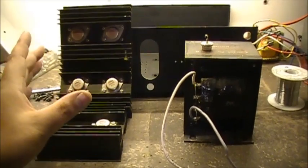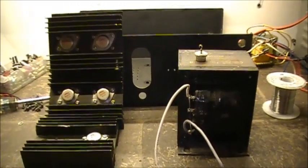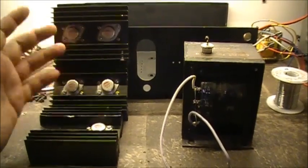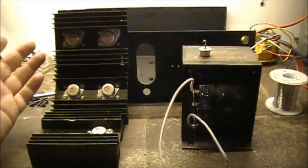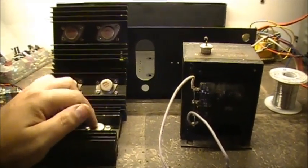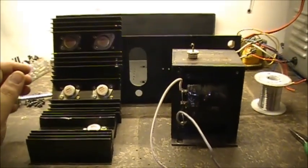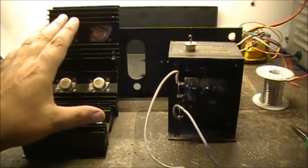But it's a circuit that I found years ago, that basically for every 2N3055 you add to the circuit, you can gain approximately 5 amps. So you use one 3055 as your driver, and then the other 4 as outputs. So technically you should get 5, 10, 15, 20. Should get 20 amps with a driver. According to the schematic, but I guess time will tell, because we're going to build a new power supply around this transformer and 5 of these 3055s.